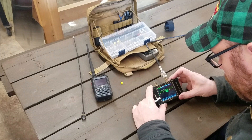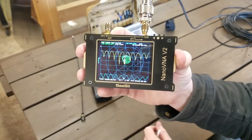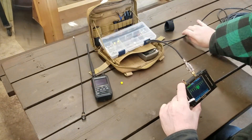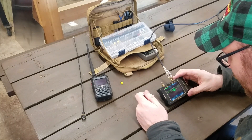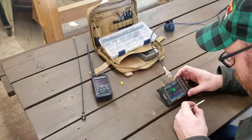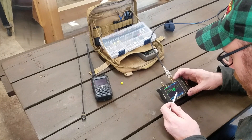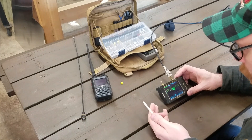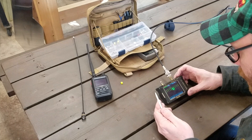Okay, we're sitting at 430 megahertz now, and it looks a little more like that — a lot more dips and valleys and things like that. However, that SWR is like 1.04 — that's really, really good. The peaks here are at 1.89 SWR, so not bad necessarily.